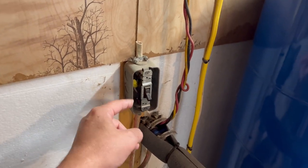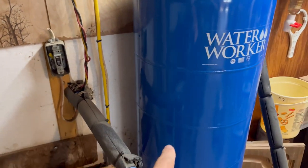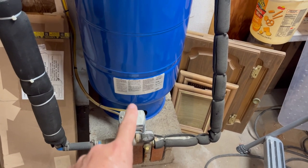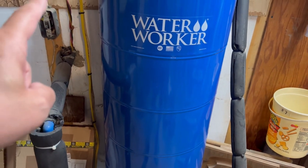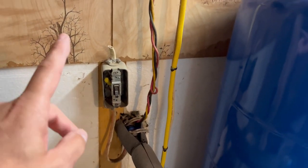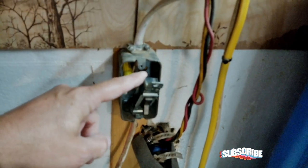You might notice that I cut this off when I was rewiring when we put a new pump and everything in. Because they had this switch tied off of the pressure switch — and we know there's 220 coming here. So what they did was just take one leg and ground to make the light work over here. I didn't feel safe with that, so I cut that off and now we're going to actually tie this in with that receptacle and get it all wired back up.